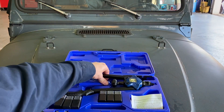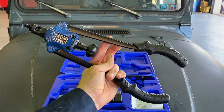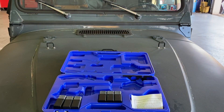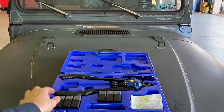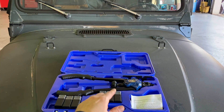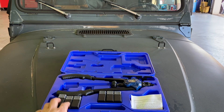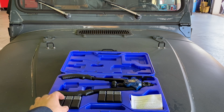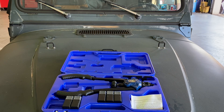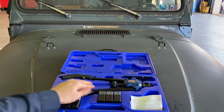What it comes with is the hand riveter, and it's a little more heavy duty than the other one — it's made to generate the extra force needed to press in the larger nutserts. It also comes with some nutserts: M8 through M12 and 5/16ths through half inch. There are also smaller sizes which come in the other kit. If you own the old kit in the red case, those mandrels will not work with this — it's a different style that accommodates the quick-change feature at the top.